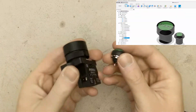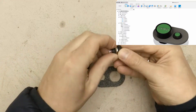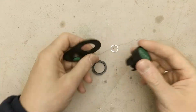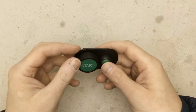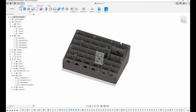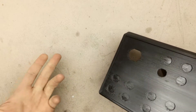The first part of creating the button box was to measure the buttons and create a holes template and check if everything is okay. So I printed this template and the buttons fit perfectly, so the templates are okay. Now it's time to design the overall look of the button box, add the holes, and that's it. It's a pretty basic design, however there are a few features worth mentioning. I added a lattice inside so the top plate won't deflect while pressing the buttons — it will impede soldering all the wires, but I think it's worth it. There's a ridge around the top plate just for the looks — this makes 3D printing harder but adds extra style points.